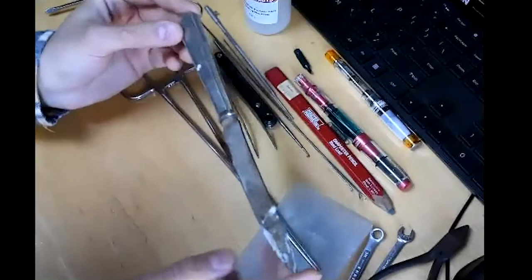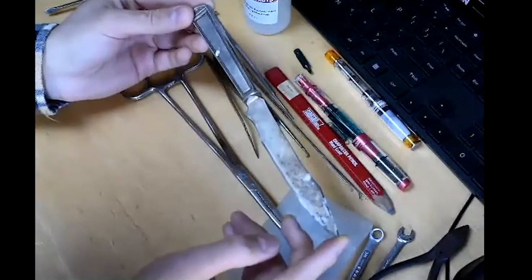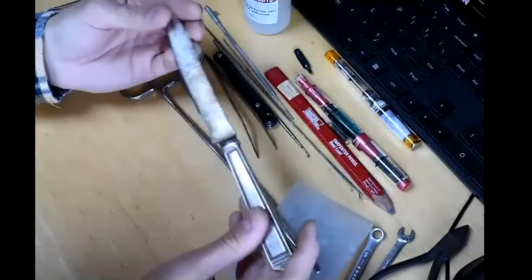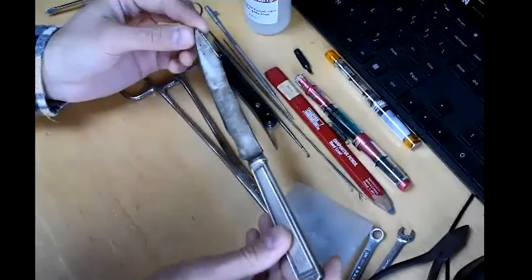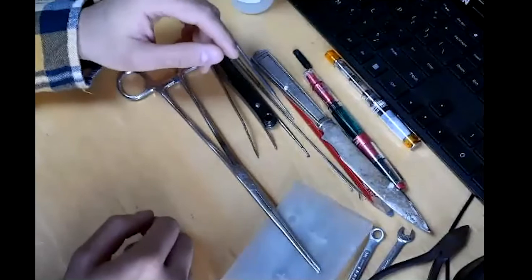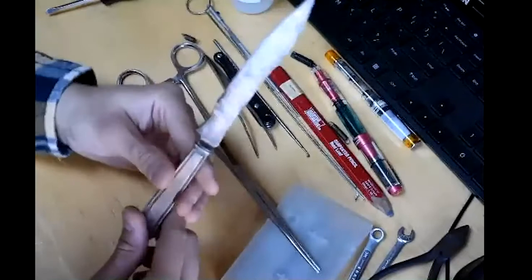You also need a knife — but you probably don't want a nice knife. I made mine out of a 50 cent yard sale butter knife. I use it for cutting rubber off, and you're going to abuse it a lot, so don't spend more than 50 cents. A razor blade or box cutter is too thin and will snap. I do recommend a razor blade for trimming new rubber — if you do the shrink tube method to repair feed rollers, you can trim off excess edges with a razor blade, saving the sturdier knife for carving off old hardened rubber.